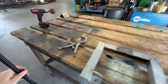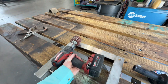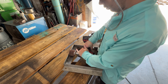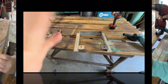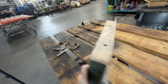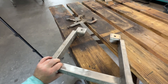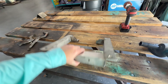The roundedness looks pretty good. I'm going one step further with this non-woven wheel — going to blend that whole section in and same thing over there. You can google 'three inch non-woven flap wheels' or 'scotch brite wheels' on Amazon and find some results. There you have it. You could go over it a little more to get it better, but for what this is it's perfectly fine — looks pretty good. You can still see a little dark area from the flap disc but it's not too bad.